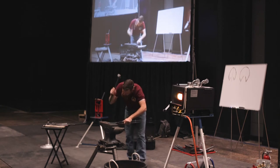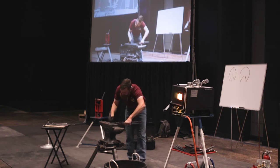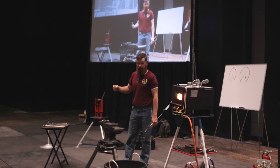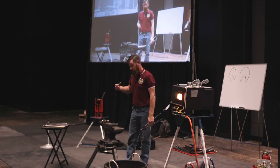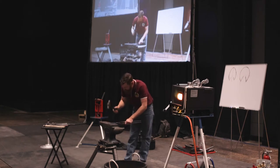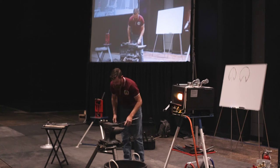Two things that I do almost consistently on every shoe are knocking off that outside edge, because it widens my section a little bit and just gets out of their way, and then sole pressure. Always knock off that sole pressure. Okay?